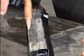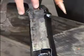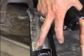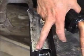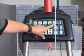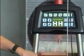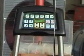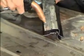We're going to use a very, very short weld time, less than 80 milliseconds, and a low power. It does make a smaller nugget, but we're going to put back in 3 times more welds than what we take out. So here we have a single side welding mode that we have to select. We've set the power at 5,000 amps, the weld time at 60 milliseconds. We're going to apply just firm pressure.